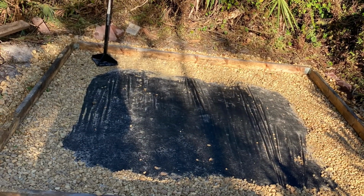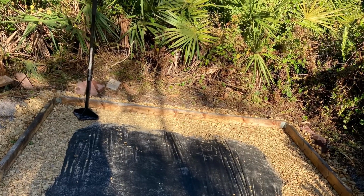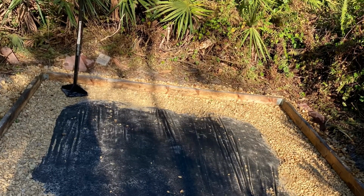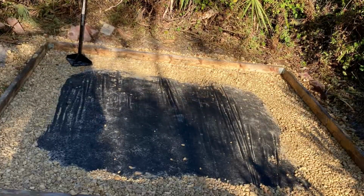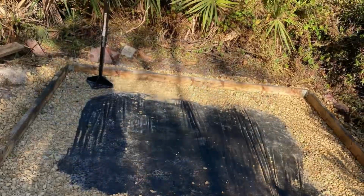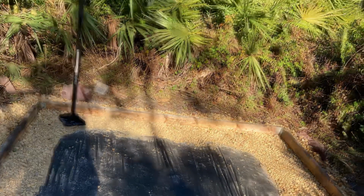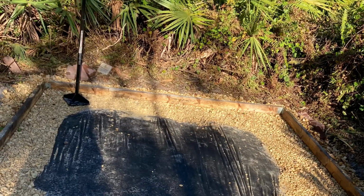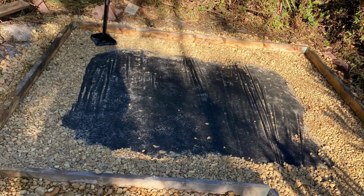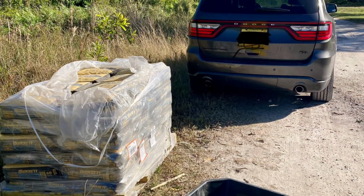I poured river rock all into the perimeter and spread it around and tamped it and made it flush all the way around, nice and flush. The next time I pour a slab, I'm going to use a higher quality of landscape fabric. Also, instead of the pond rocks and the patio blocks, I would use exclusively the crushed granite because the crush has a jagged edge that increases the surface area and adheres to the concrete better.